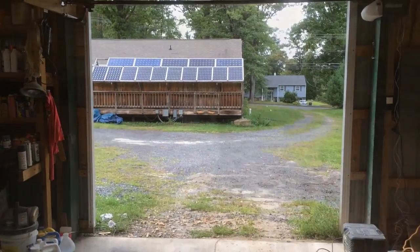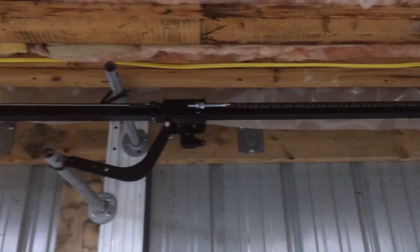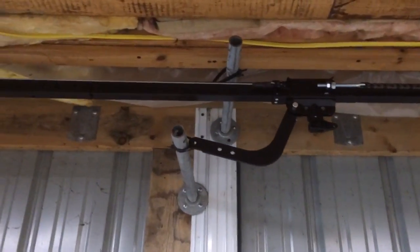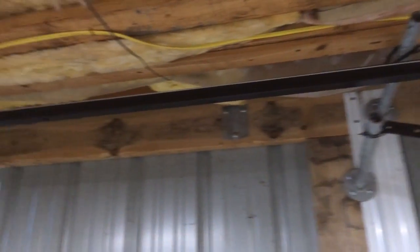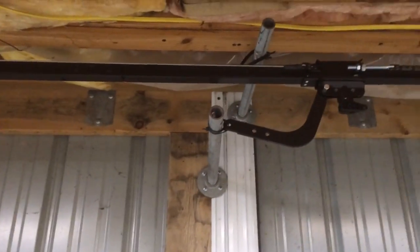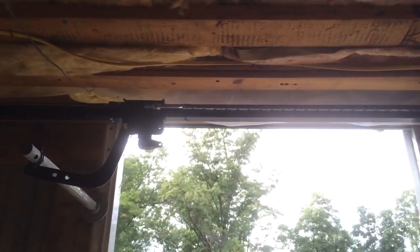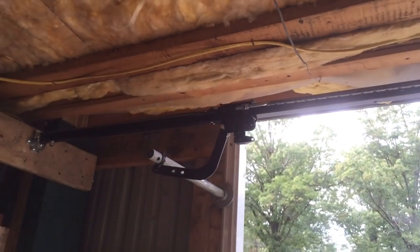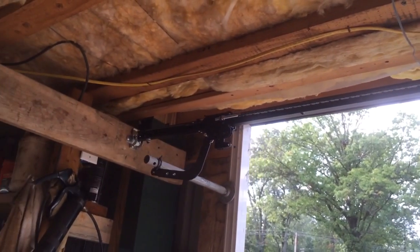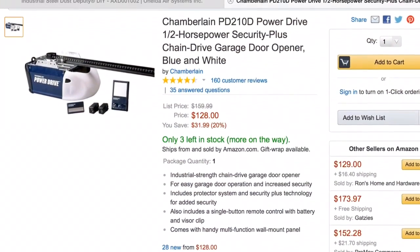The way I figured out how to do it was I took two one-inch pipes and attached one to each door using a floor flange, then simply attached one pipe to the normal opening mechanism and the second pipe to the back side of the chain that's going in the opposite direction. Such a simple solution — I've seen other people who have opened only one door, which is easy. This way you can open both doors at once.